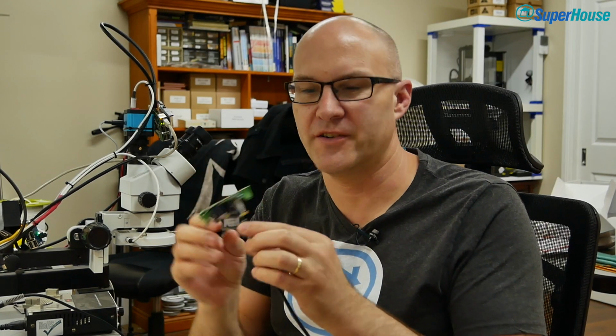Now this entire video has been filmed without having mains power connected to this at any point. All of this flashing and configuration has been done purely with the Sonoff powered by the USB to serial converter. Never try to connect up and reflash these while they have mains power applied. It's really dangerous. But now the time has come, we can disconnect from this and connect it to mains. Once it's connected up, because it's got Tasmota and that supports over-the-air updates, we can now push new updates of firmware to it over Wi-Fi. We don't actually need to reconnect the USB to serial converter again.